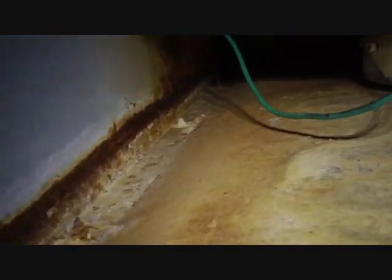That's not a very good sign — you can see definitely water has been standing in this unit and draining out. Unfortunately, on the Goodman variable speed air handler's left-hand discharge, that's where the water has been standing — right in the module for that motor. Whether or not we have a problem with that motor I don't know yet, but we can see why. I replaced the board years ago because of a flooding issue and the motor was still fine, but I don't know if it's happened again. You can see why it's been standing in here — either from a blocked drain or a coil freezing.